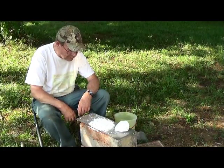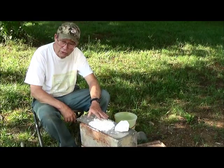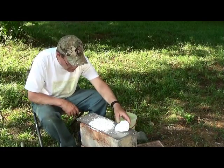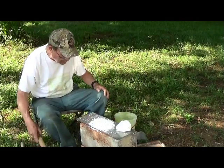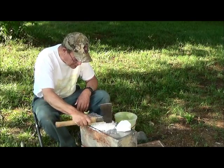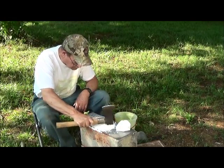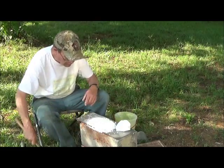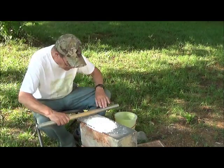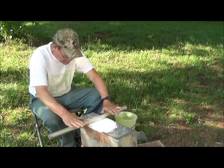We are now concluding with our adventures in ceramics — making up the kaolin and sand clay for filling the holes left by drying from the mudding of our forge. And this is the lump of kaolin, and I have crushed it. Now we are about to grind it and sieve it. We have our temporary workstation here: two concrete blocks and a stainless steel sheet. And this will be disassembled and repurposed as soon as we get through this phase.